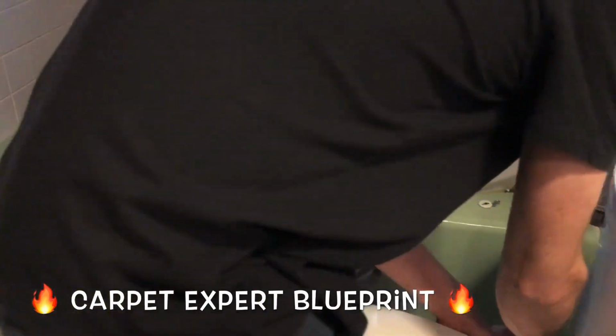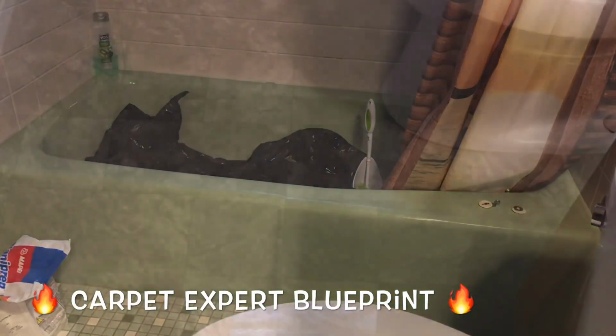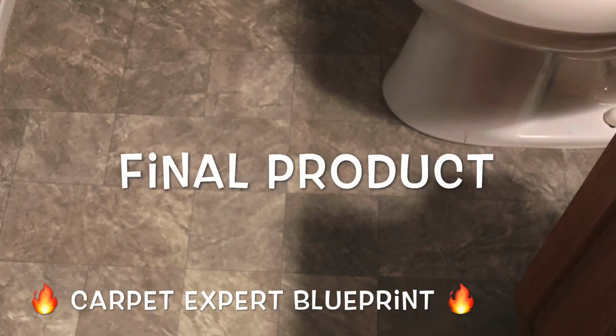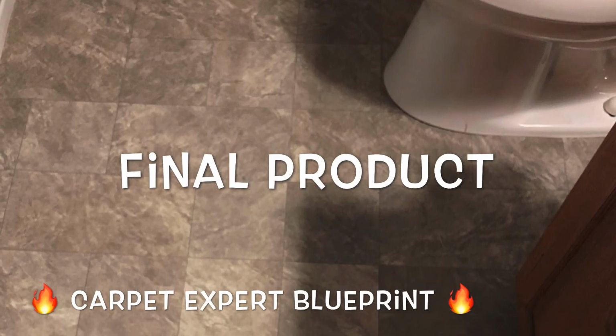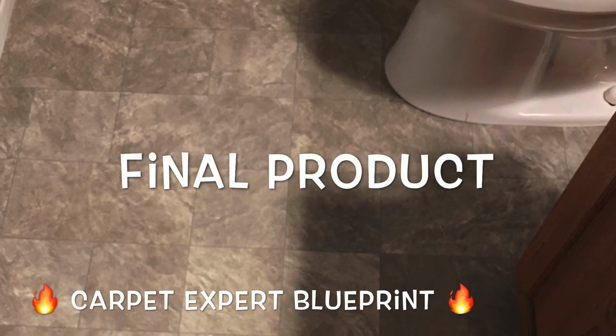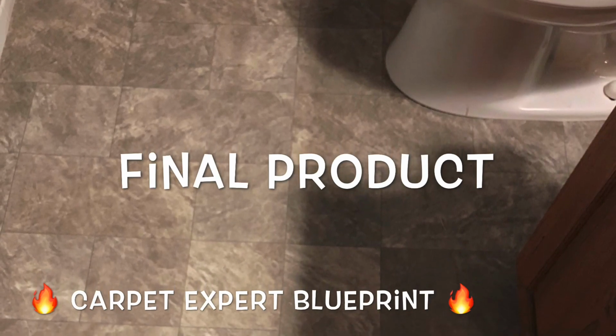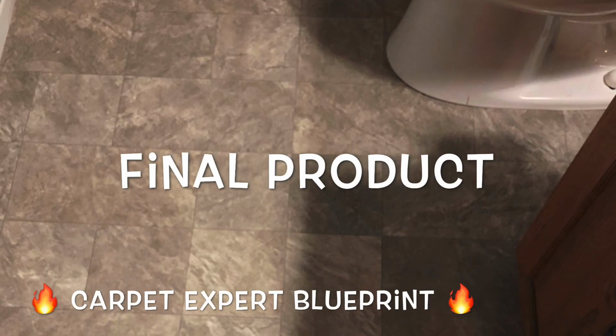But nothing's happening because someone epoxied this to the floor and it was mosaic tiles, and if I continue pulling, I was going to break out the existing floor. So we went ahead and left it in, reinstalled the supply line, put the bolts back on, and then installed a vinyl sheet flooring, cutting around the toilet, and caulking it in. Something I hate doing, but sometimes it's got to be done. Obstacles in life, man. Don't let them hold you back.